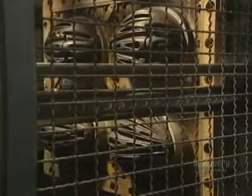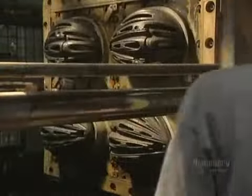The contents of this bin will be able to produce about 20 foam pieces, which will take shape on these molds. The press closes up for the 6 minutes that it takes to mold 4 foam pieces. The particles fuse with steam before being cooled with water.